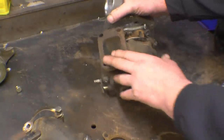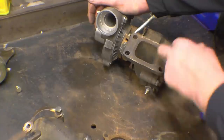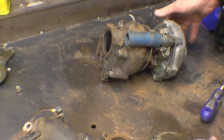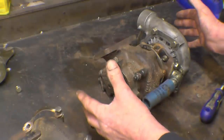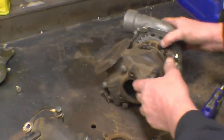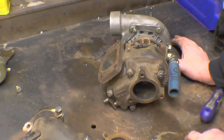It's going to be a good project. There's loads to do engineering-wise - things to weld, things to make, some electronics, ignition circuits. It will make a nice compact little jet engine. I didn't want to get a big turbocharger because then you need a big burner can, a big oil pump - it just goes on and on. This is going to be a decent size that I'll be able to pick up and carry in and out of the workshop.